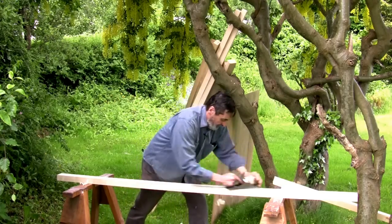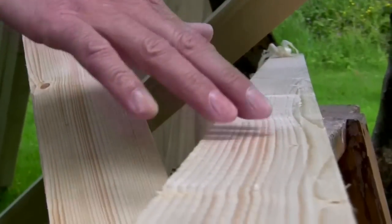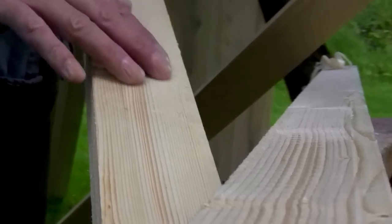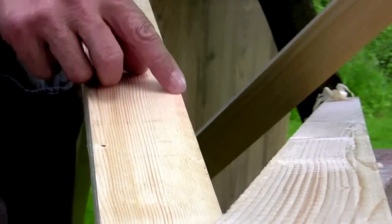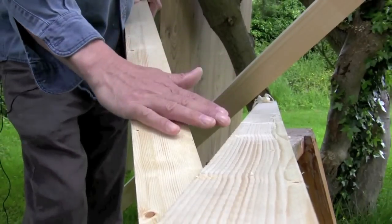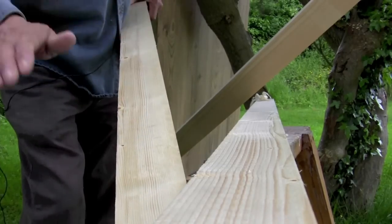Knots again. If your plane is sharp, it'll probably stay sharp long enough to do the whole of your bench top laminations. Each of the slabs we're making is 12 inches overall width. Just to make sure you know what we're trying to get rid of: on this surface it's got marks left by the pressure bar that feeds the wood through the machine. The pressure bar has left bar marks in the surface. Those have to come out because they'll stop the glue surfaces from forming between the two pieces of wood. This is saw kerf, and I have to take this surface down to that surface to make sure I get an even film of glue over all the surface — that's really all we're trying to do.